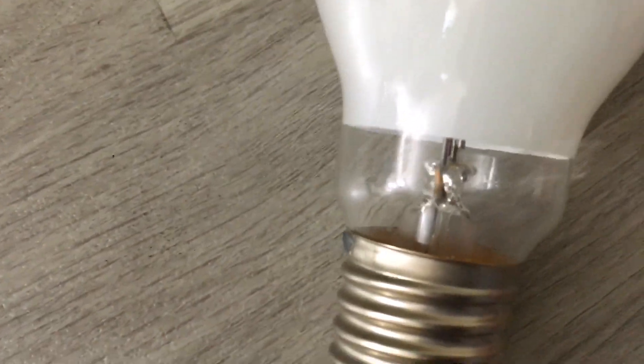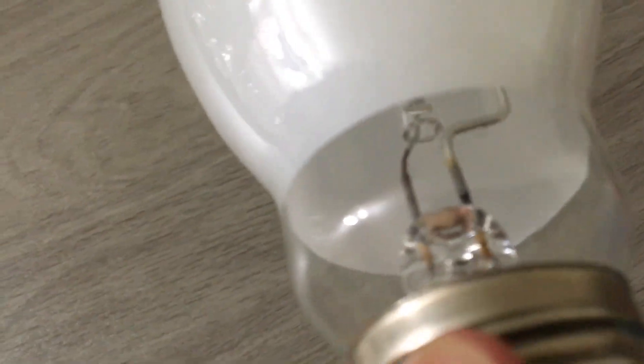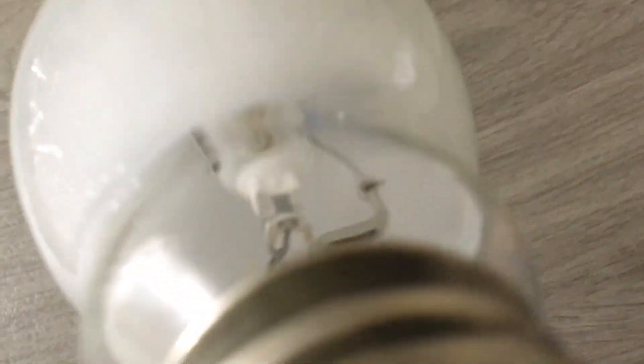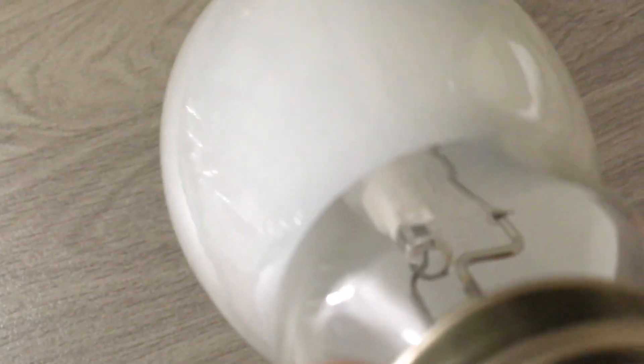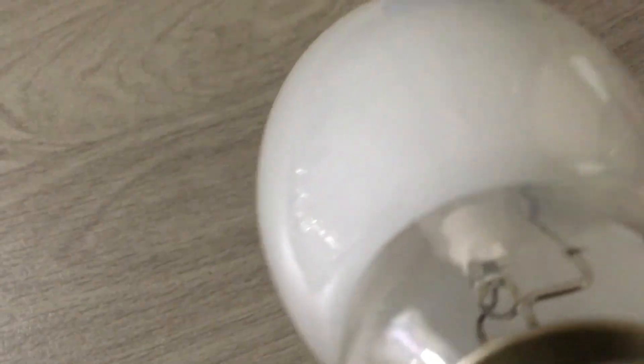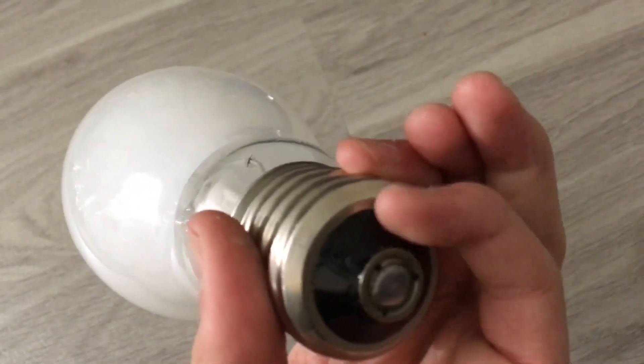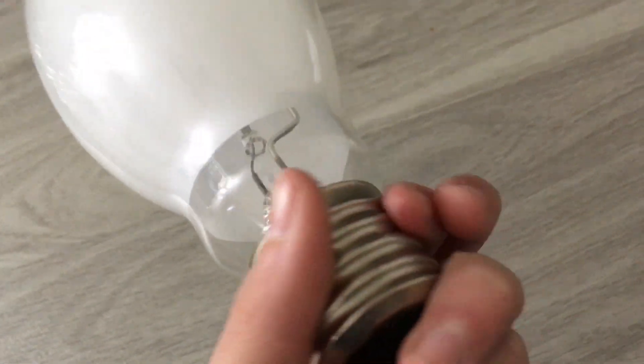You can see the stem right there — very nice. You can see all the wiring and the welding process used to connect to the arc tube, and there's the arc tube inside, sitting and floating in the bulb waiting to be turned on. You can see a quartz tube right there on that lead wire, to help prevent the lead wire from melting from the intense heat of the arc tube. There is a coating of ceramic on one end of the arc tube and the other end as well, meaning it's a universal burn position. We also have the dimple for extra support for the arc tube, and a very nice hard aluminum base with a glass insulator.